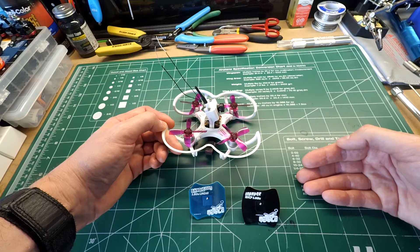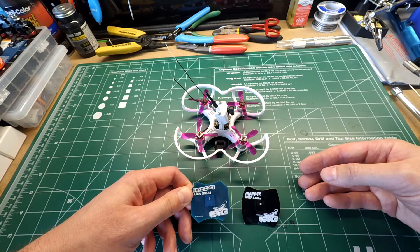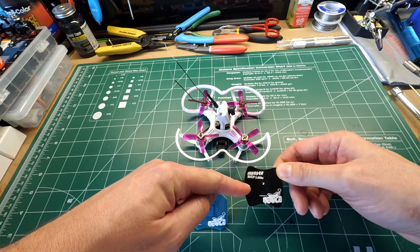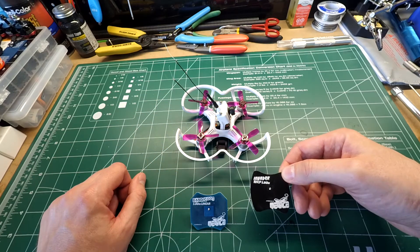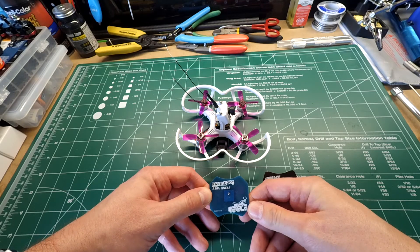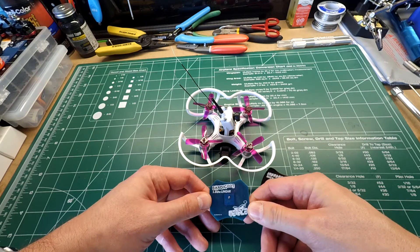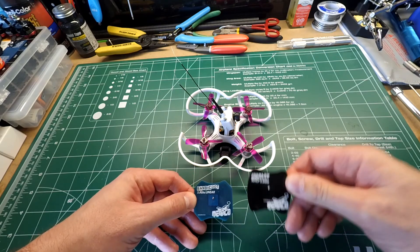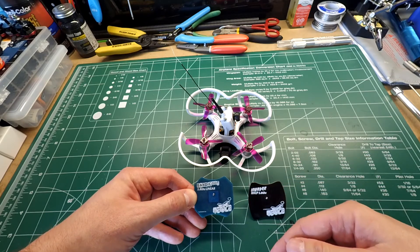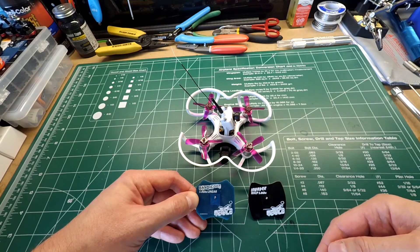What the Bandicoot linear 5.8 gigahertz patch does is it keeps you from mixing mismatched signals. This is a linear antenna — with a circular polarized patch there's a polarization mismatch and you're going to get loss. They've come out with the Bandicoot for quads that use a linear antenna, and it's going to match perfectly with this patch antenna. I've had great success — I ran the Invader against the Bandicoot, and the Invader drops out very quick as opposed to the Bandicoot, which pretty much smashes it because it's actually a matched polarization between the two antennas.